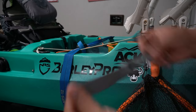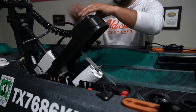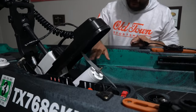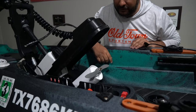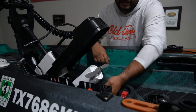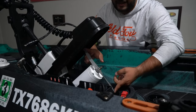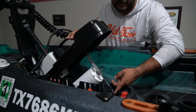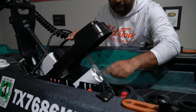Nice and smooth. You can get a little sandpaper to even all that out. What this is going to allow it to do — whenever you're disengaging and reengaging this motor — you want it to be able to still come up if the prop is sideways in the water. It's got a little spacer right here that the blade can actually hit, and it'll self-correct. It's too long as it comes out of the package, and this motor will get jammed up when you're making it go up and down if you don't shave off about half an inch.